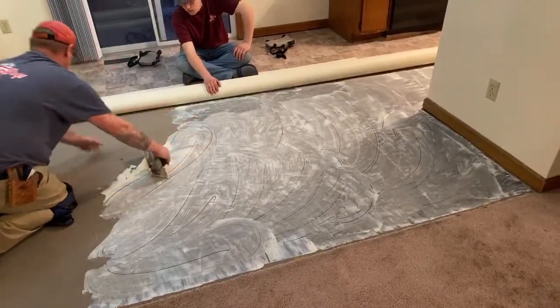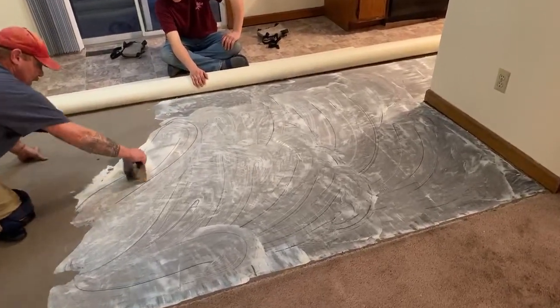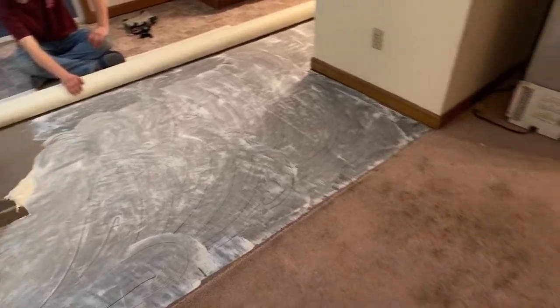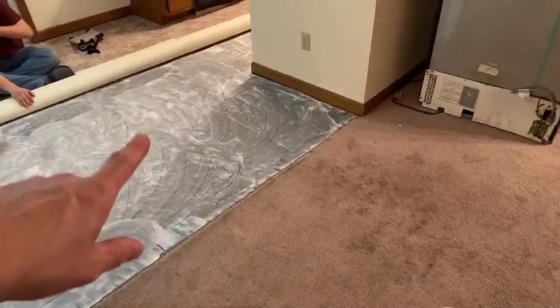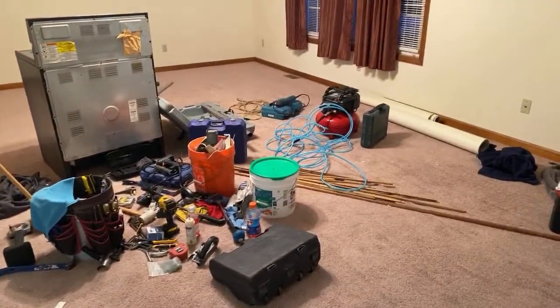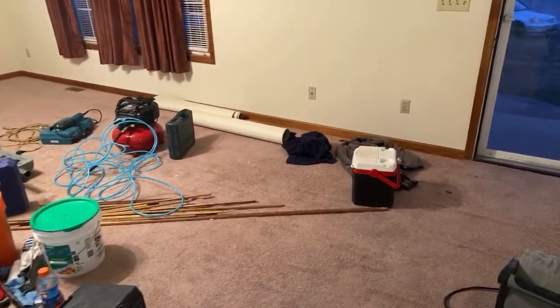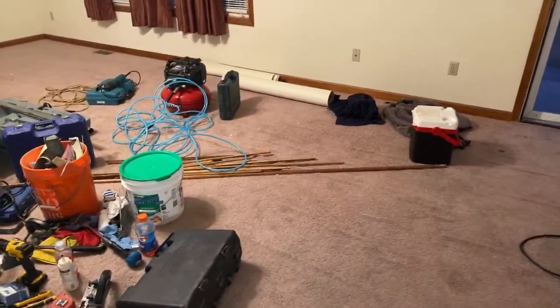You can tell by the way the glue is spreading that it's nice and smooth — it ain't got a bunch of deep spots or divots. It turns out pretty nice, it just takes a long time to prep. We did two coats in this bathroom and two in the other one. The third one we only had to do one coat because we went over an existing glue-down vinyl — just one coat of mud to skim over the grout lines so they wouldn't telegraph through.